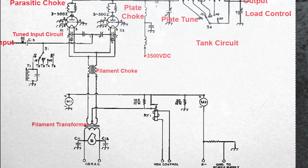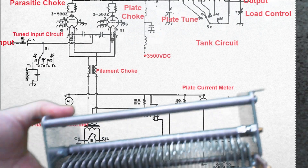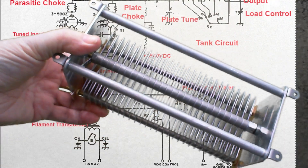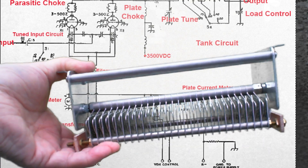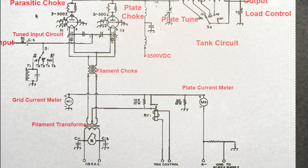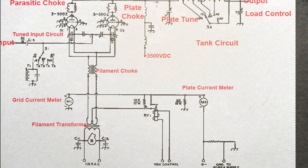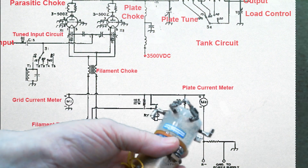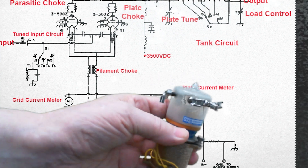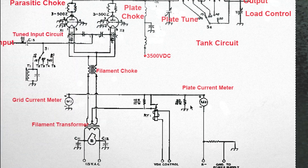The capacitors that make up the plate tune can look something like this. Versions could be smaller or bigger. This one's designed for fairly high voltage — you can see the separation between the plates. I mentioned the changeover relay. In one amplifier I used this vacuum relay, which is really ancient, but in one position the amplifier was in the circuit and in the other position it was out. Using a vacuum relay, those things literally will last forever.